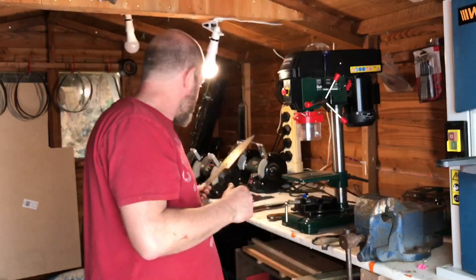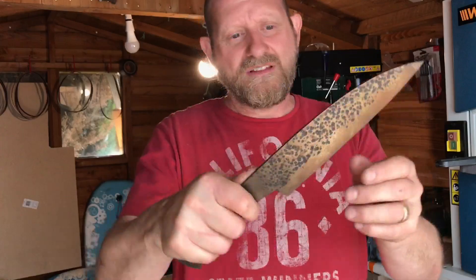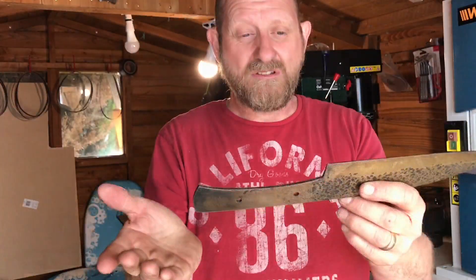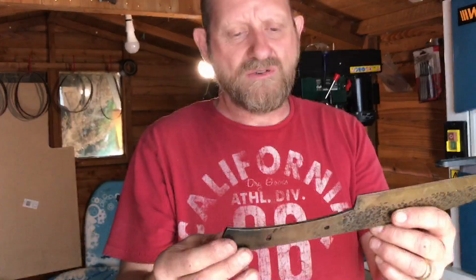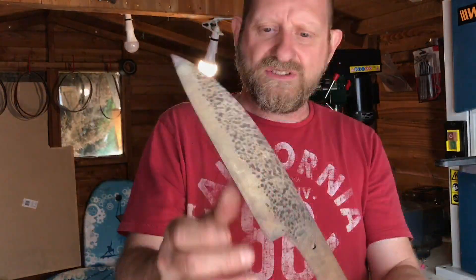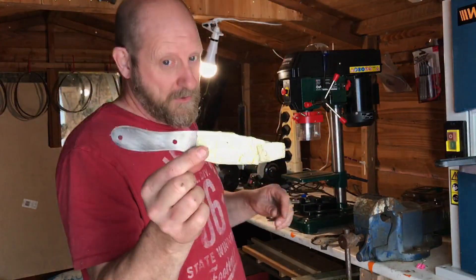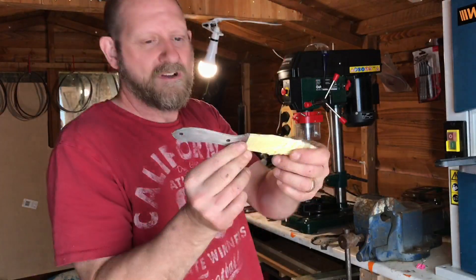And this is my third project. This is something I wanted to do differently — it's going to be another kitchen-style knife. The steel I'm using for all these blades is either 1070 or 1080, because of the difficulties with 1095 or tool steel with heat treatment. But that's something I'll go through, because I've got a pretty good system. I've got a Devil Forge and a good method of monitoring temperatures quite closely, so I think tool steel — or 1095 at least — could possibly be doable. That's my knife setup at the moment. There's one more I'm doing for my daughter — just a little general knife which I'm making now, and that's going to have Kirinite scales on it.